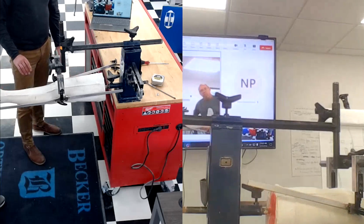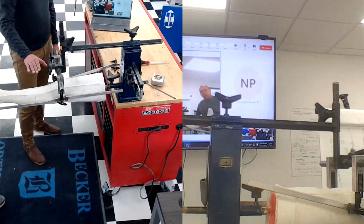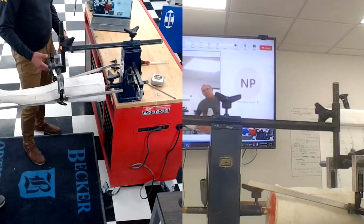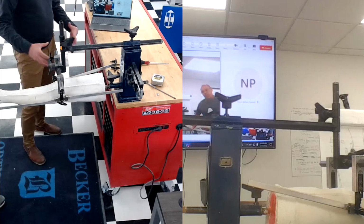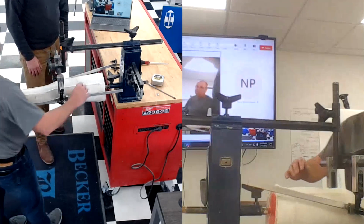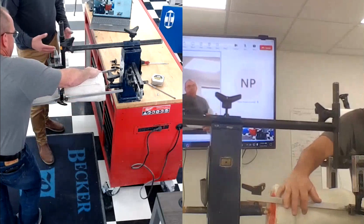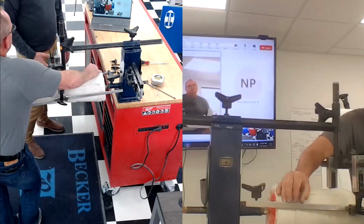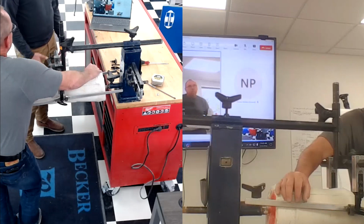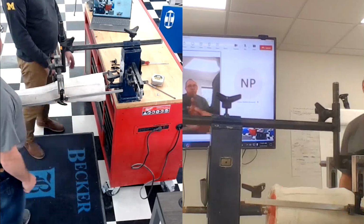What you want to be careful of there is that you're doing it equally on both sides, so that there'll be less squaring process for you at the end when you finally assemble it all together. Our habit, of course, is to correct the mold into the alignment that's desired prior to pulling it, but certainly swinging can occur if necessary, or if that wasn't done in the original creating of the mold to begin with.